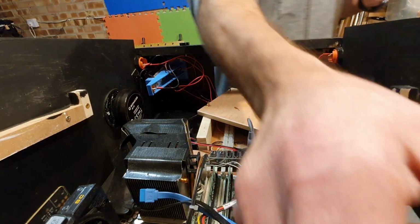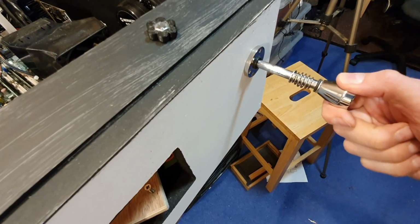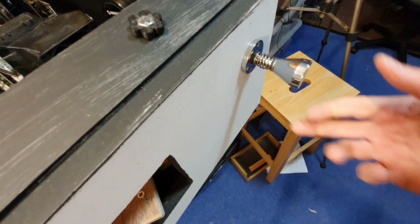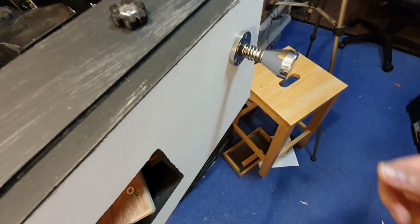Right, a comparison. First, the new spring. It feels so much better. I can easily pull the plunger back with a light grip. That was a big problem with the other spring, as the plunger is fixed to the potentiometer inside, and pulling back a heavy spring made it hard to pull back straight, which would twist against the mechanism inside, potentially causing stress on that delicate part.